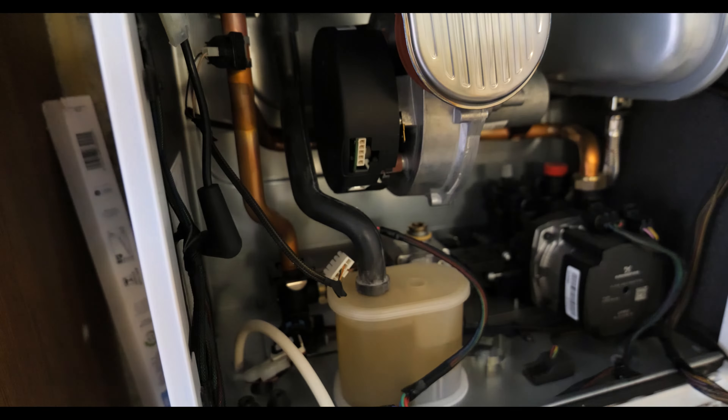Just for visual purposes I've got a sample of the water we're flushing through and I've dipped the magnet into it — you can see the sludge and debris that's just from this small section of water. It's actually quite bad, surprising how bad it is. Give it a good flush through and make sure it's all clean before getting the heating back up and running. The condensate trap is okay, burner inspected and sealed, heat exchanger all clean — everything visually is pretty much done. The flue is okay because I installed it, so I'll just check the terminal and then do the performance checks.